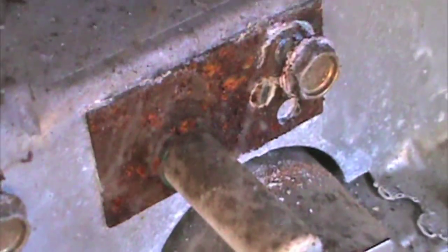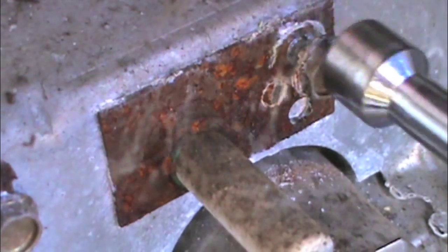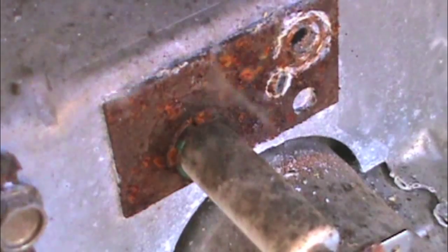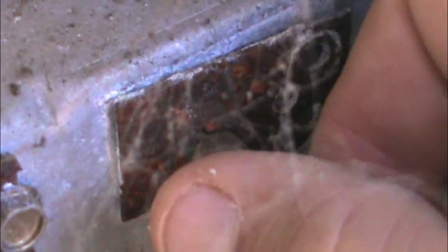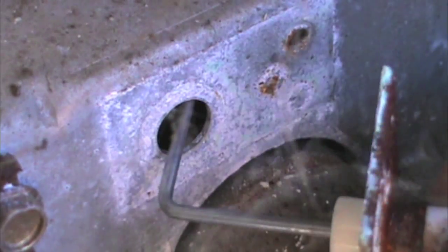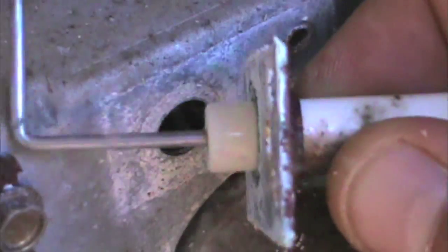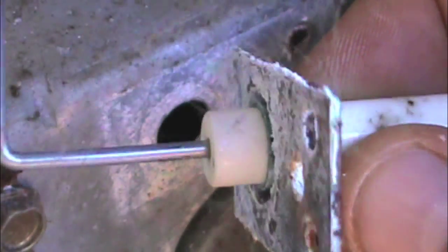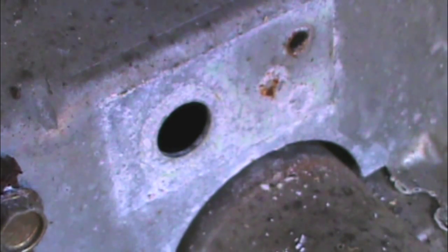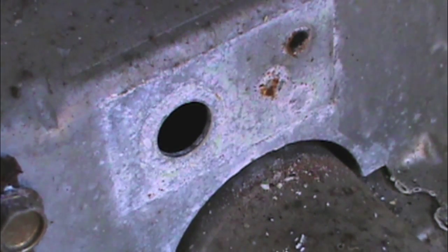Let's see if we can get a little bit of footage here. I'm going to take this guy out — this is going to be the sensor. Now these things are delicate, not as delicate as the hot surface igniters, but pretty delicate. This is ceramic here, and we've got a rod that comes out. As you can see, this discoloration starts and it gets pretty prevalent to the end of the tip. It doesn't look bad — I mean, don't get me wrong — it doesn't take but a minute.